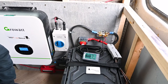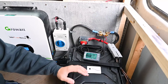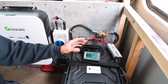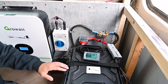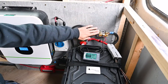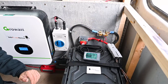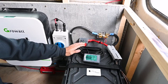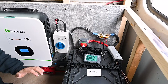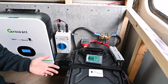Right here on the right side you'll see the first components of the system. First you'll see these batteries monitored by this shunt, showing you the battery levels and how much charge is actually coming into the battery itself. The shunt is installed right here, which allows the screen to monitor all the inputs and outputs of the system. The next part of the system is a disconnect switch, which allows you to turn the battery on and off from the rest of the system for any maintenance purposes, allowing you to work on your system safely.